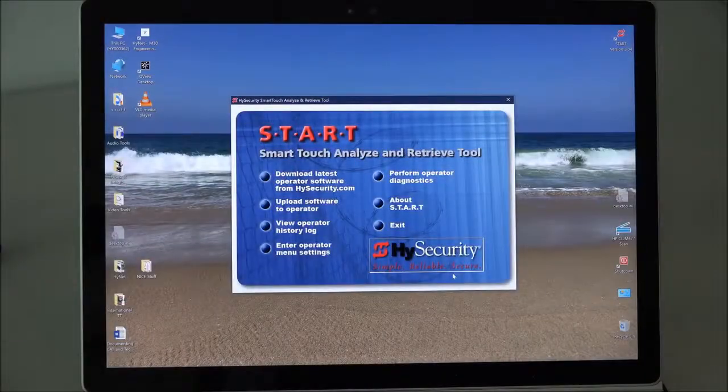Yeah, one more thing here. I previously showed you by pressing the menu key one time on the keypad and watching the display that you could review the settings, the build year, the operator type, the handing, and the usage class. And so we wrote those down, and we'll re-enter those once we put in the new board.